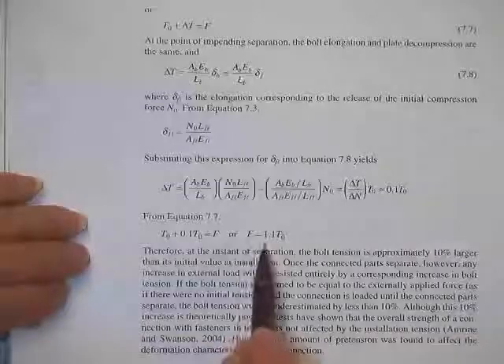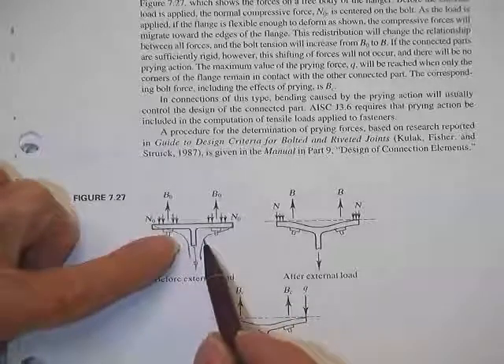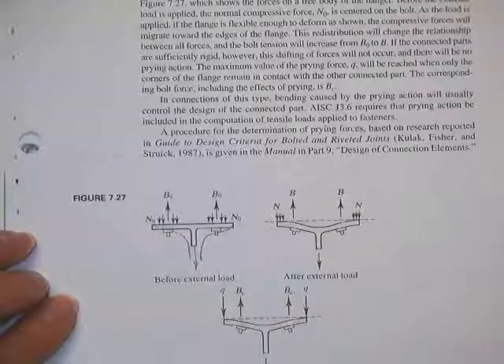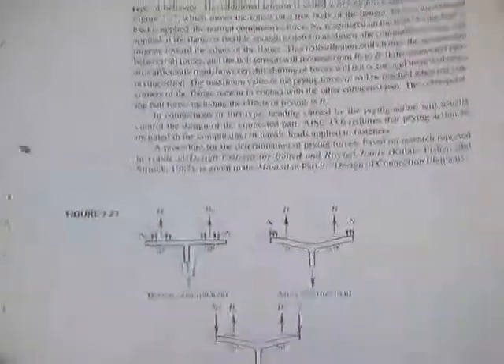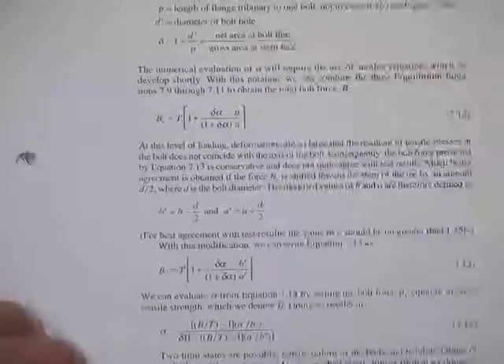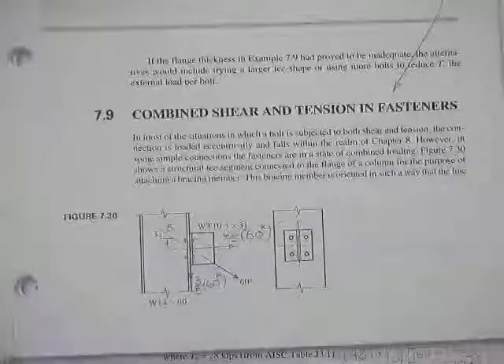Here's his derivation: delta equals PL over AE. Forcing the bolt about 10% larger under extreme conditions. Prying action is when you pull on this T and tend to bend the surfaces — to keep those in equilibrium there's actually a moment in there. There's no end to how many things we could cover; this is one of the things we don't cover. So if the problem says 'include prying action' — ignore it.